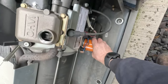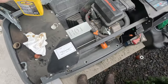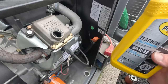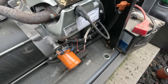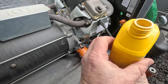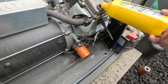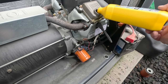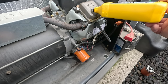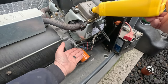We're looking inside the old filter for shavings and making sure everything is smooth and clean. Let's get this new filter on. The oil I put in the filter — look, nothing comes out; it's absorbed into the membrane. We can slowly maneuver it over and let it continue dripping into the bucket. Now that we've got the oil out, first thing I like to do is tighten up the drain — hand tight, not stupid tight. This generator can hold anywhere from 1.5 to 1.9 quarts, depending on the model — check your book. This one is 999cc, so I'd bet it's 1.9 quarts. We go in at a sideways angle and drain the oil in there. We'll go ahead and get it refilled and check the level as we get close, adding until we reach the proper level. Allow it some time for the oil to drain to the very bottom.